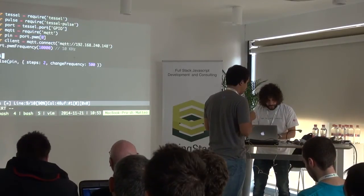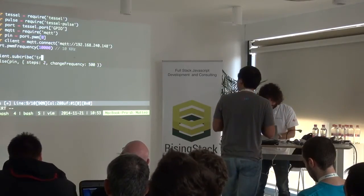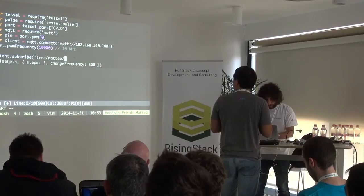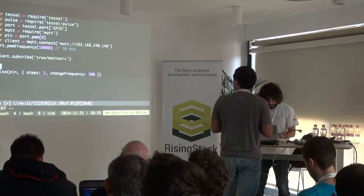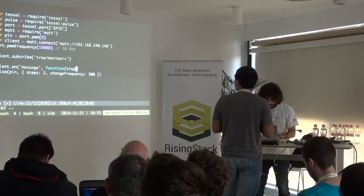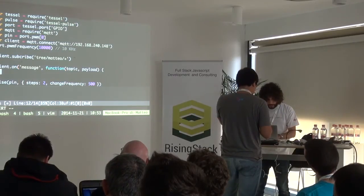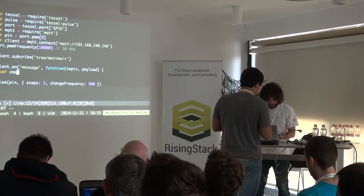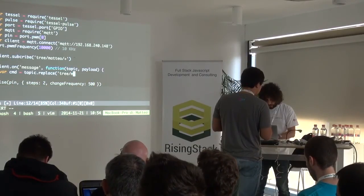We need to subscribe to something because it's a publish-subscribe protocol, right? So let's call it tree/Matteo, and this is a wildcard, so it will get all the commands. Then when we receive a message, we can do some stuff. We receive a topic, which was published, and the payload. On the topic, what we need is just a command. So we just replace the base part of the topic, which is tree/Matteo, with nothing.